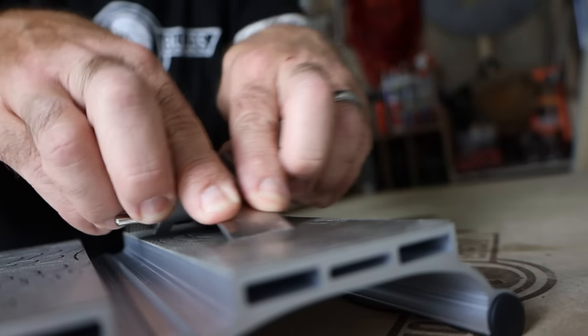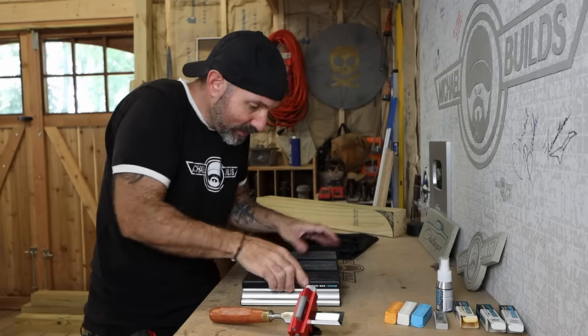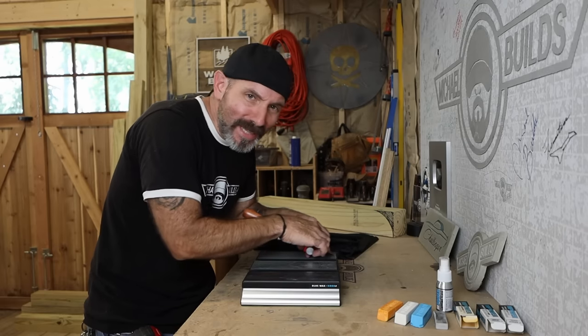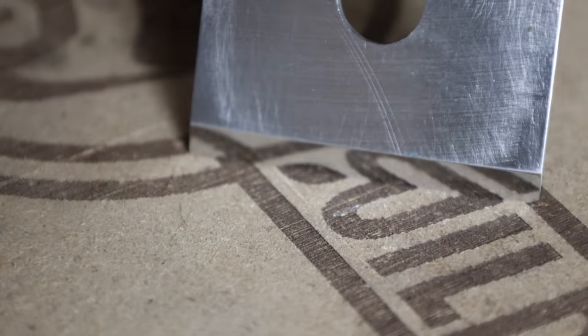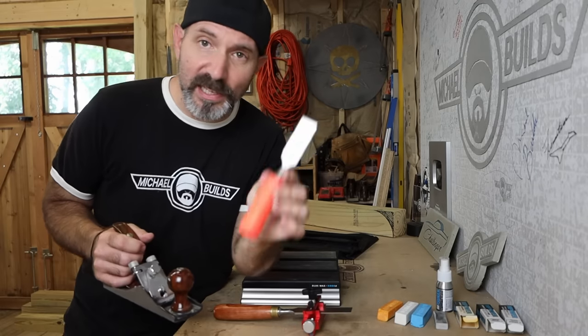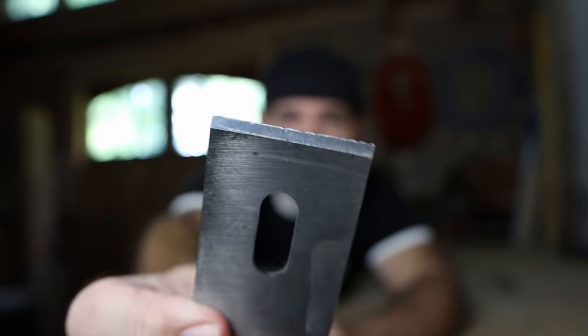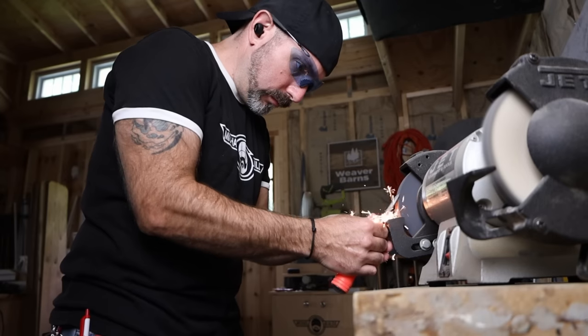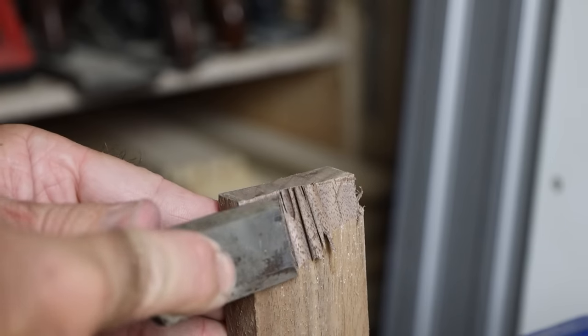It comes with three different grits: 300, 600, and 1200 grit, but it also comes with three leather strops which go up to 1800, 2500, and 5000 grit — this will get you a mirror polish. It comes with three different wax grits to coat the leather strops with, plus a lapping fluid and an eraser to clean the strops or diamond plates. You start off with the 300 grit, work your way up, set your bevel, then add the leather strops. About 10 to 20 strokes on each strop and you'll get a mirror finish. I even rescued a cheap chisel and a planer that had hit several nails — they both work like a dream now. Empower is not sponsoring this video and there is no affiliate link, so I am not making a dime. This is just a really great tool I wanted to share.